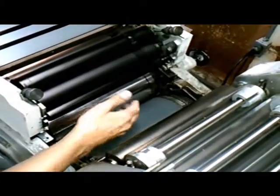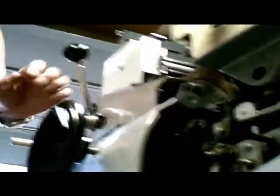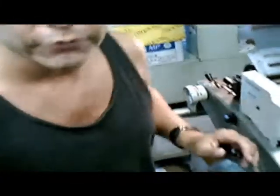There are three main cylinders: a plate cylinder, a blanket cylinder, and a cylinder underneath the press called the impression cylinder. By squeezing that paper between the cylinders is how you get your impression. Thus comes the term offset printing — that's where the name comes from, because the image is actually carried from one place to another. It offsets to when it's finally on the paper. This is the main section of the press, which mostly consists of imaging with ink and water and carrying your impression.